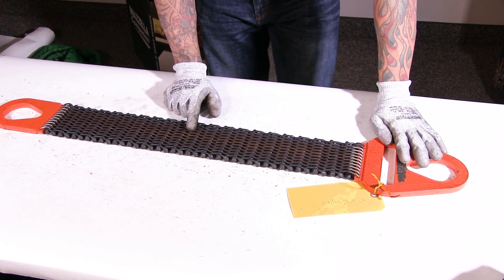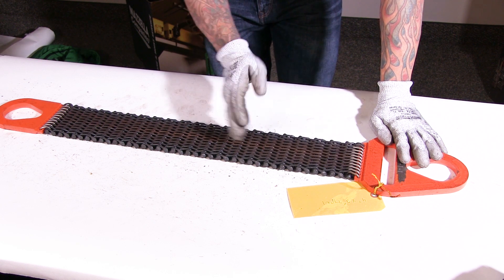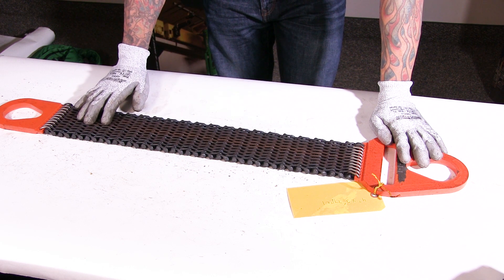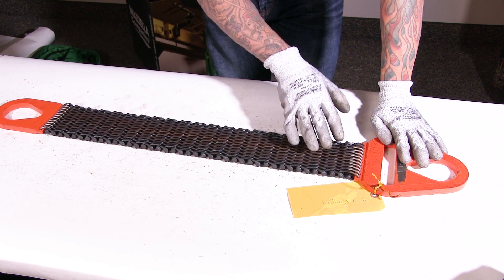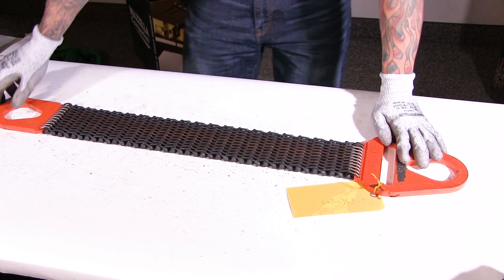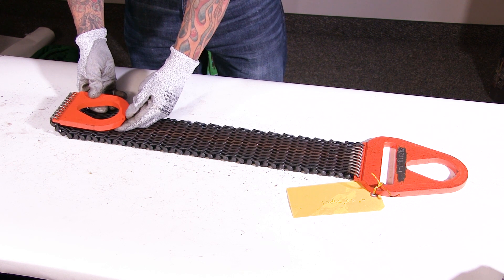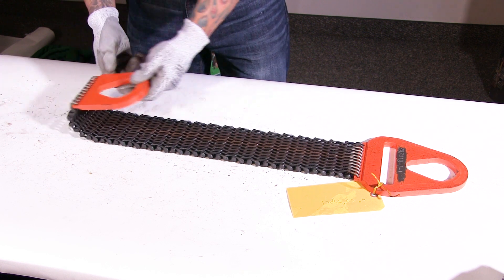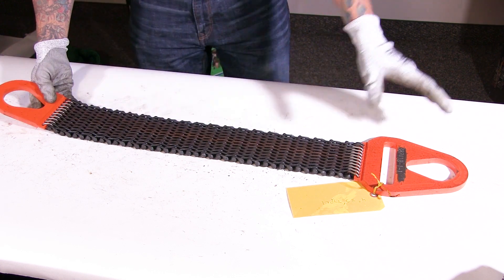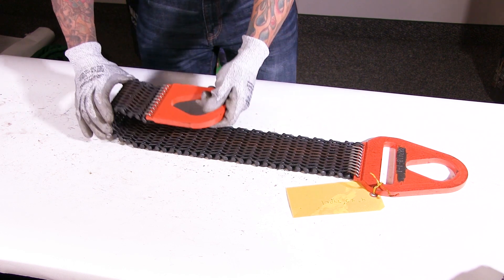Then in the body, I'm looking for all the typical failure criteria. We want to make sure the wire mesh is not crushed, not gouged, and that there's no heat damage that could come from weld splatter, arc burns, and whatnot. Coming to the back, the male fitting — make sure this fitting is in great shape, and that nobody has modified it by welding on any handles or doing anything unnecessary.